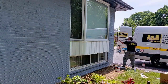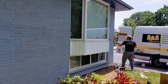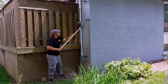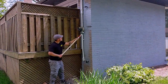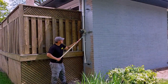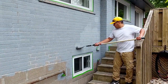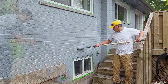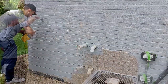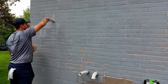Once all the tight areas of the masonry around the home are fully cut in, the crew starts to apply the first coat of LiquiStone on the bricks. As you can see, the rolling of the LiquiStone on the bricks requires proper time taken to make sure the LiquiStone fully covers all areas. As the bricks are porous, the crew really need to take the time to fully make sure that all possible surfaces are fully covered with LiquiStone. This is very important to maintain maximum protection of the masonry and have a job that will last decades.